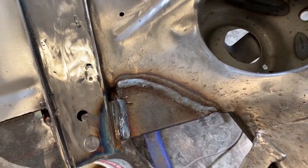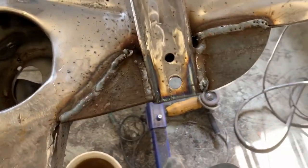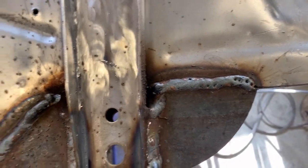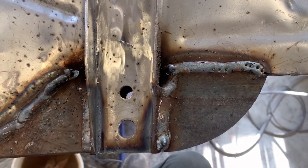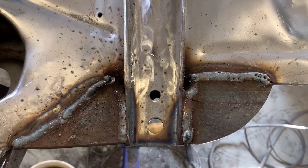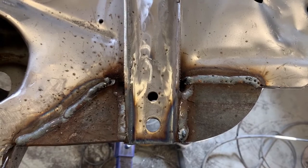Here's the bottom side of the driver's side. I kind of alternated. When you start getting bubbles or pinholes like that, that's your first clue that you don't have enough shielding gas. When I saw that I checked my bottle and realized it was empty, so I'm done welding for the day. But we've got other things we can get accomplished today.